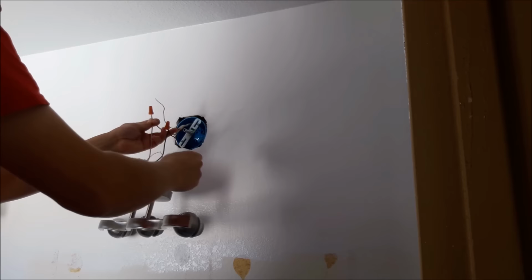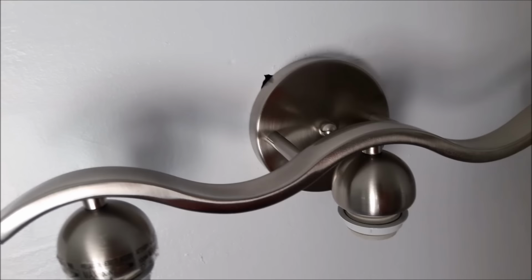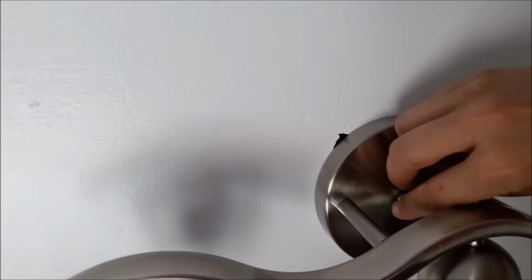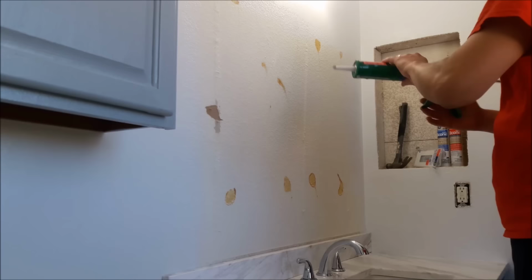Now we're flipping back to the lights. Double check that your power is off. You'd probably know if it wasn't. But it really is as simple as color-coded paint by numbers there. You only have three wires. Just make sure that the wire nuts are tight, and you can tell my lovely little gap that I made there because, yes, my drywall wasn't cut well enough.